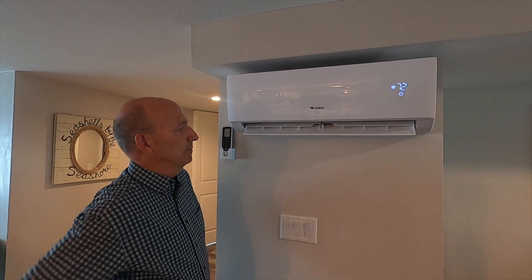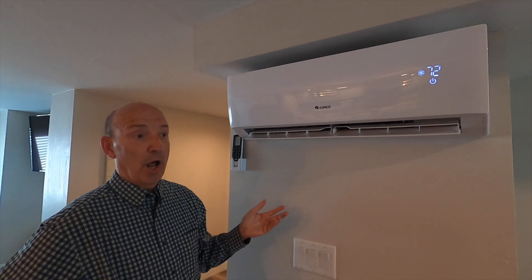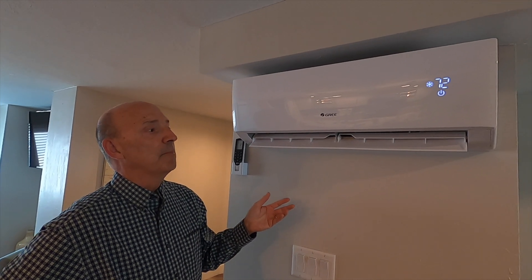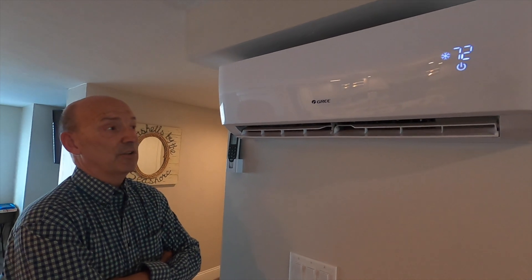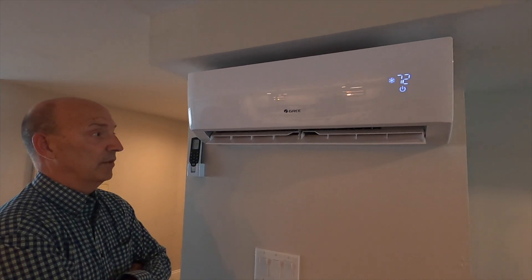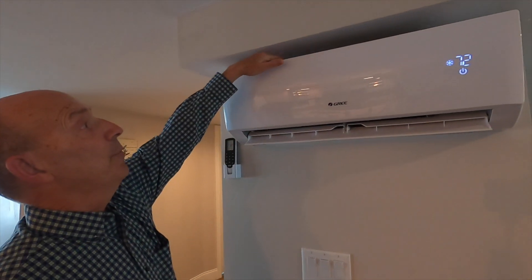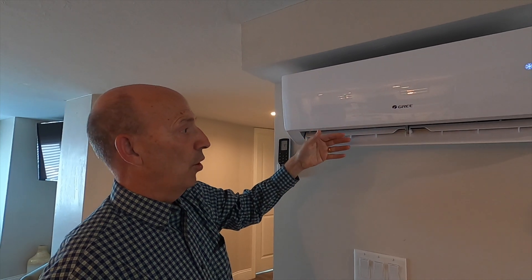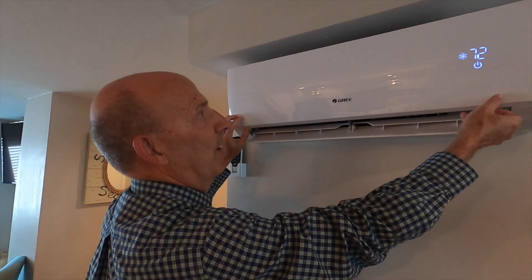This unit actually heats as well, so it's a heat pump — both heating and cooling. If you've got a four seasons room or a garage you want to heat and cool, this would definitely be high on the list. They're extremely efficient; the efficiency ratings are really high, which is another reason they've become very popular. It takes air in the top, runs it through the filter and coil, through the blower, and discharges it out the bottom.